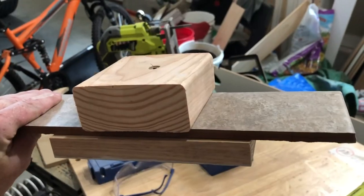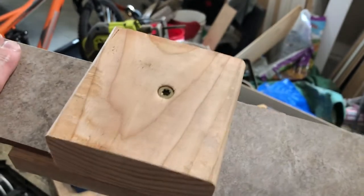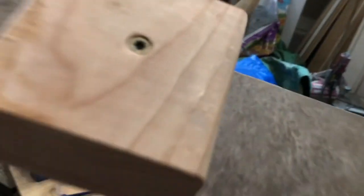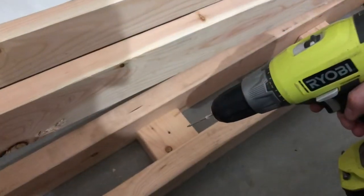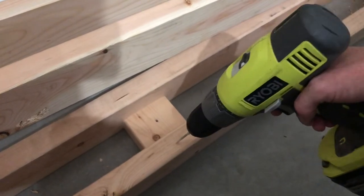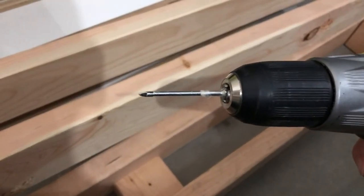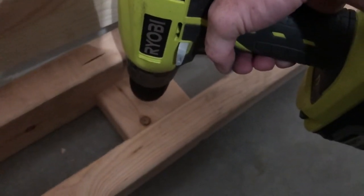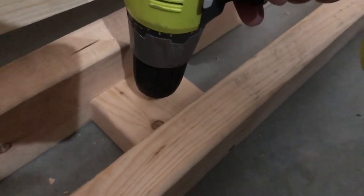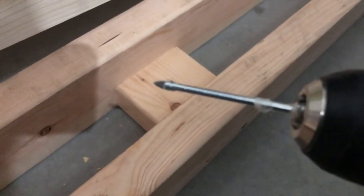My final example — a two-by-four through the tile into the subfloor — looks and feels very secure. I'm going to keep with those screws and probably just do one each, so I'll have three screws going into the floor, then use liquid nails to further secure the step onto the tile. My plan for when I go upstairs is to use the tile drill bit — the smallest of the four sizes, which is 5/16ths — to fit through my pilot hole and start a hole in the tile in just the right space without measuring or marking.